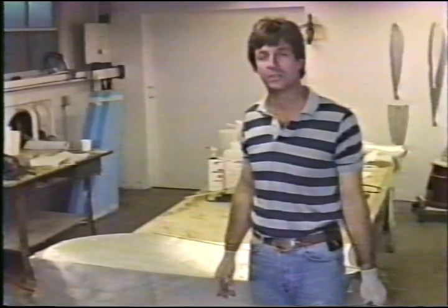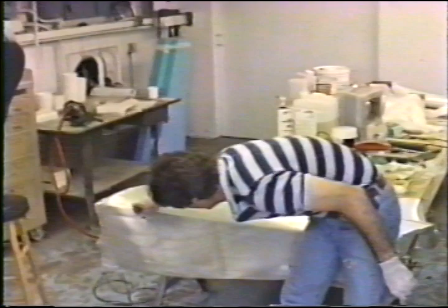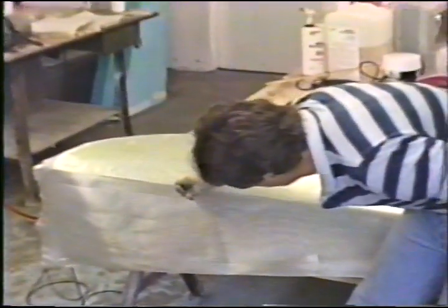This is the last section of this tape. We're going to show you the leading edge lap. A simple way of obtaining that is to use your hand as a guide just above the leading edge center line, and with a felt tip marker, ride down the surface, leaving a mark. Folding underneath, making sure that it's going to go far enough to lap the area you want it to. We have that. We're going to cut it off real quick.